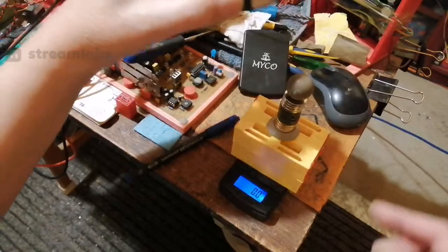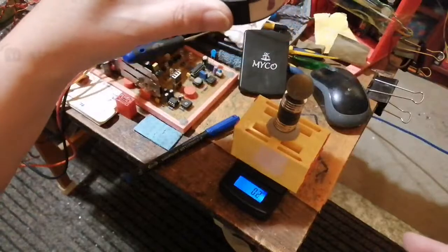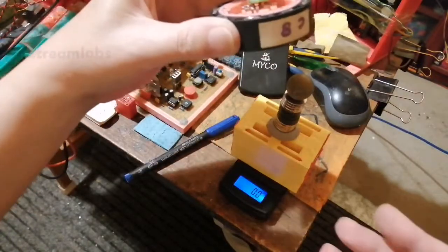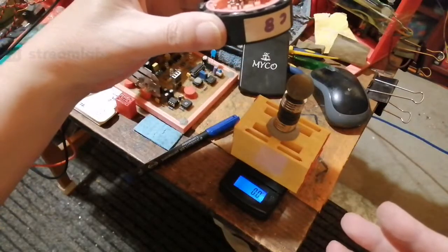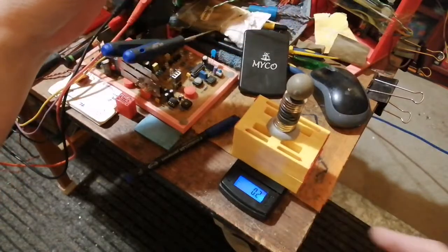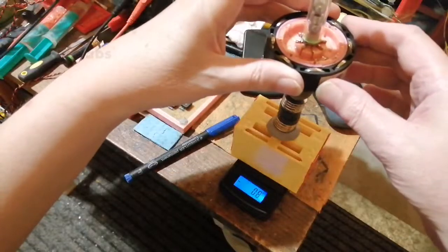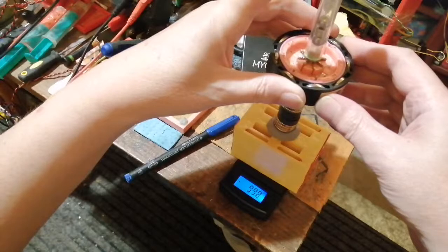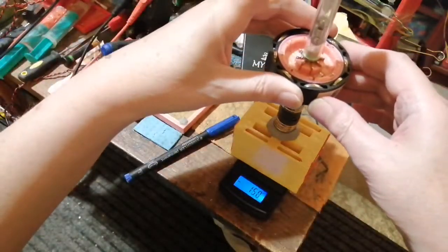So, having a minus reading is good, because remember, we're actually pushing, the rotor is going to be pushing the magnetic field on the external rotor assembly. So, by having an attraction, it wants zero in again. By having an attraction on the drive side, it actually adds more to the rotation. So, we have it deflecting, and you see a minus reading on the scale.